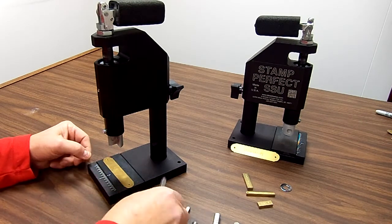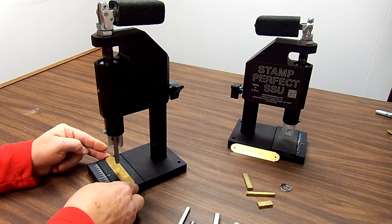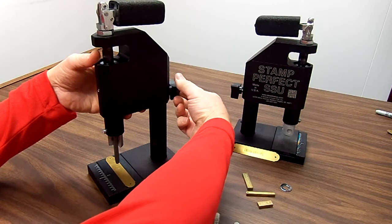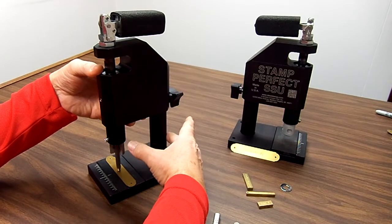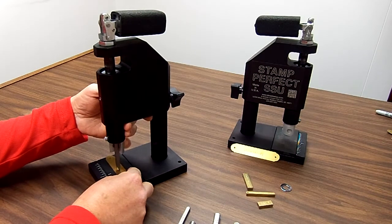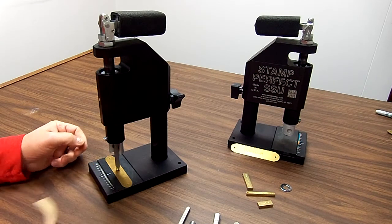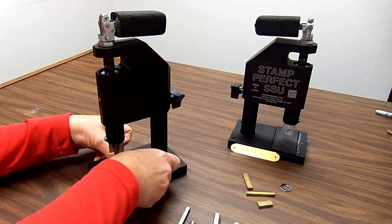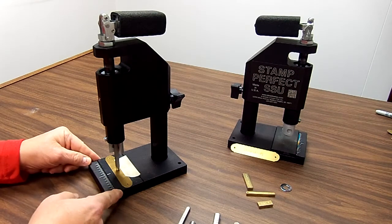I'll show you how easy it is to set up. I'll put the 1/8 inch character in here for right now, and what I'm going to do is position the piece under the stamp to mark. I'm going to loosen the little column screw again and let the machine head fall right down on the column until the stamp rests right on the piece to be marked. Then I'm going to tape it in position on the sliding anvil, which will allow me to not have to hold the piece underneath it.